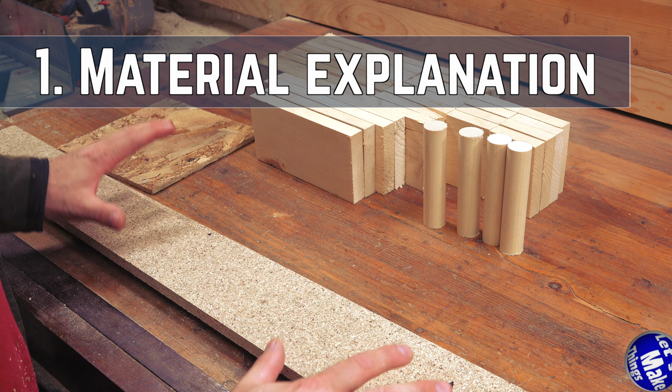We'll grab our rails now, and we're going to place the arrow down, and then we'll flip it upright. We want to find the center, which mine is 4 feet, so I'm going to go to 24 inches, 2 inches from the other edge, and then we'll come 12 inches in for the middle pieces. We'll line our rails up, we'll drag a line across on all 5 marks.